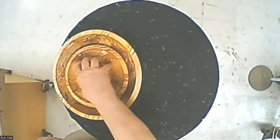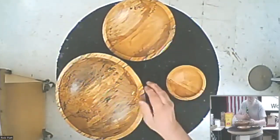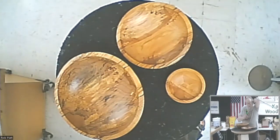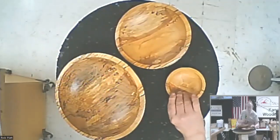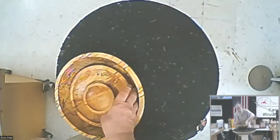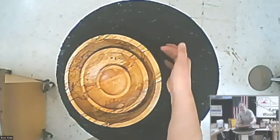This is another set of bowls that came from Jerry Darter's shop — he was cleaning up. This was something he had cored a long time ago that just sat there collecting dust. When I got it, it hadn't been turned at all and didn't have any tenons, but it had been cored completely dry. I just turned it and put on a Danish oil finish — three or four coats — and it's got a nice satiny finish. I like them and I like this undercut rim. My real disappointment is that the further up you go, the smaller the bowl and the less exciting the grain is.